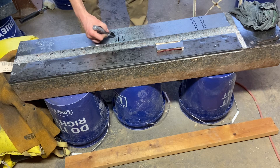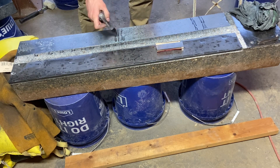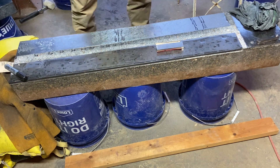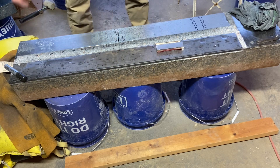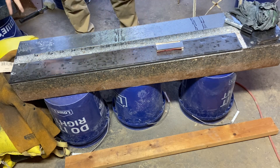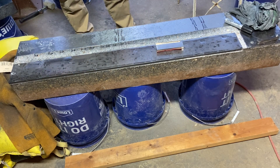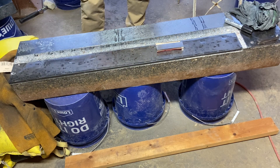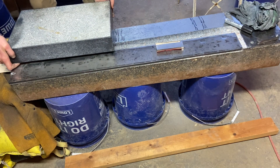I'll have contact here and then contact at the far end and nowhere else, then I lower that spot until I get full contact along the full length of the plate again. I've done that maybe 10 times now and I'm finally on the last section at the end. My sections are getting a little bigger because honestly I'm a bit tired of this, and I'll be using this end less, so I'm a little less concerned if it's not quite as perfectly straight there. This is my first pass on this very last section.